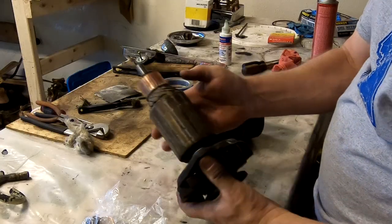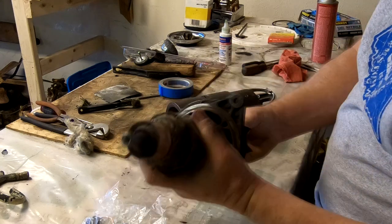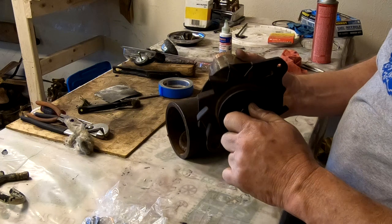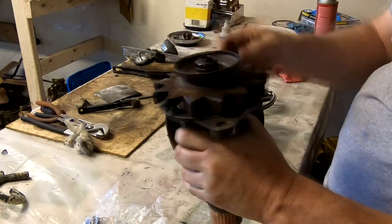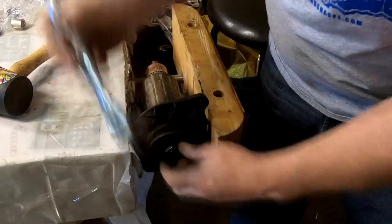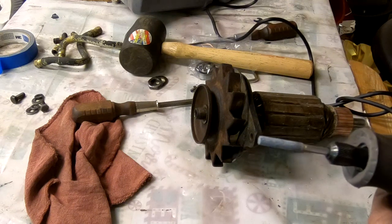This armature was pretty dirty and we cleaned it up as best we could. We took a wire wheel to the commutator here, but it needs to be sanded and cleaned up some more. The first order of business is to get this armature separated from the rest of the body. There's a little flange here that holds the bearing in place — we've got to be able to remove this as well. The order of business is to take this bolt off, remove this flange, turn it upside down, and knock that shaft down through.